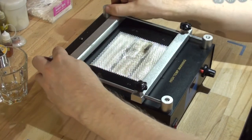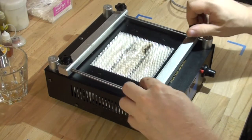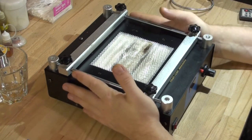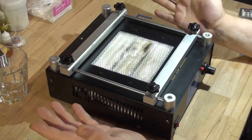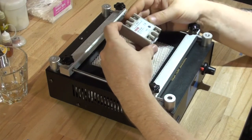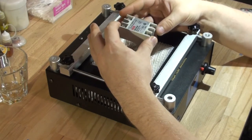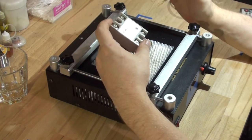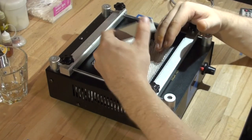I will be using this for preheating — just the enclosure and the heating element; the insides will all be gutted out. Another option is infrared heating, but we're trying to make a budget one. A 500-watt floodlight works just fine. To actually drive it, we're going to use a solid-state relay — this is a standard SSR-40, rated at 40 amps. However, I will not be trusting it at full 40 amps; I'm comfortably going to run it through a 500-watt floodlight or similar load, maybe up to one kilowatt.